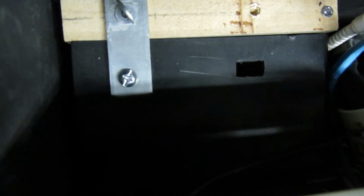It has two primary power sources, the 3-volt DC bus and the 12-volt Arduino supply, which are provided by plugging standard wall adapters into a power strip within the box. This is contained in its own module to prevent contact with users or other electronics.